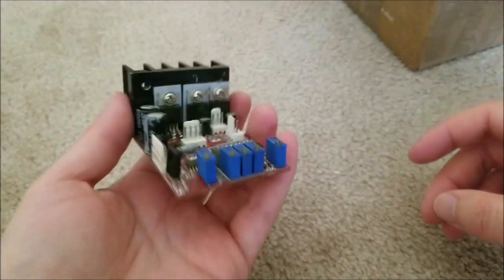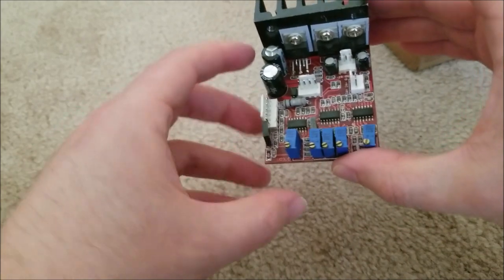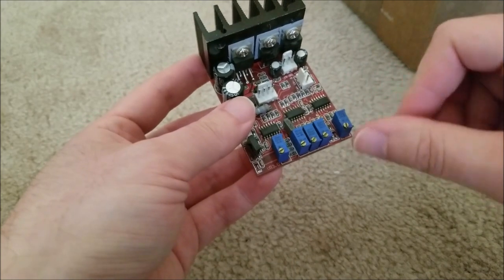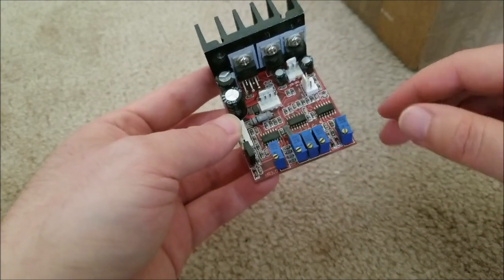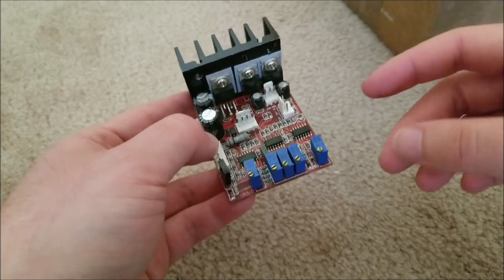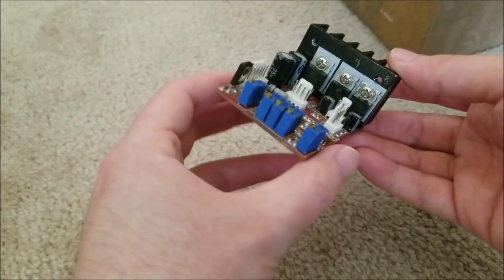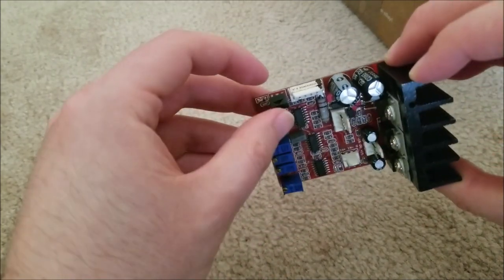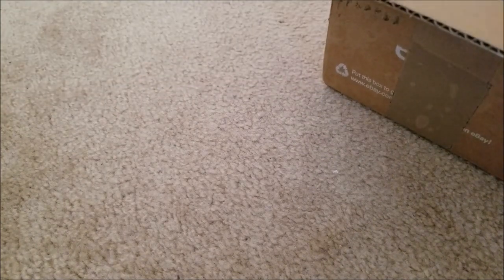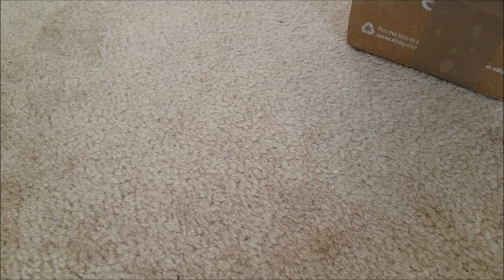Let's unpack this one by one. This looks very similar to the one that I have — it's a Galvo controller, basically. Different trim pots at the bottom for adjusting the gains for the compensator. It's basically a closed-loop system, so you set an angle and the motor is supposed to zone in on that with minimal latency. This is going to be a laser Galvo driver. That's gonna be fun. And I believe there's another one — yep. So we have two. Why do you need two drivers?